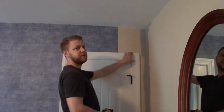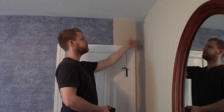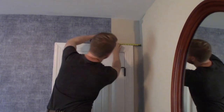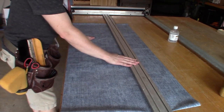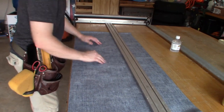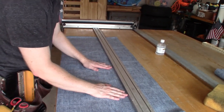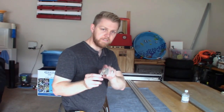For this last piece, get an exact measurement from the previous piece to the corner of the wall, measuring at both the bottom and the top. Since Steve has a straight edge, we can cut the wallpaper with it. The point is to get your measurement from the edge of the paper to the straight edge, cut along that edge, and the edge you just cut is the one that goes in the corner of the wall — so you want that to be a nice finished edge. The measurement is 12 and a quarter inches. Make sure you have a nice sharp blade.